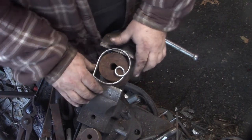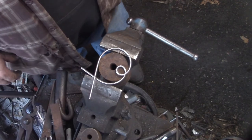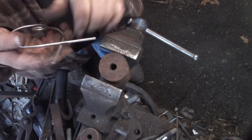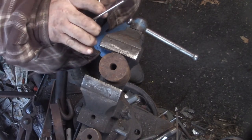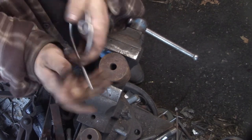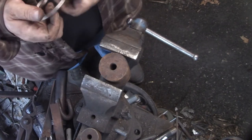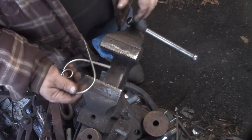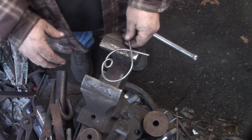And that's why I also, on that little vice jaw, I put 5/8 posts in it, but the bender takes 1/2 inch. So I cut one off and I rewelded a 1/2 inch post on it. Now I can use all, and I think you can even see them. There's one sitting behind there, the vise. So now I could use those for other things, not just the Hossfield type bender.